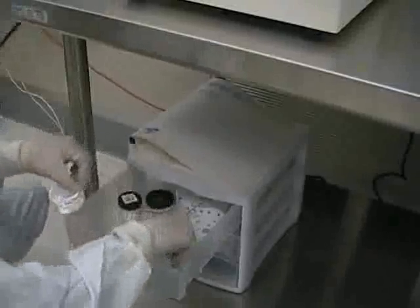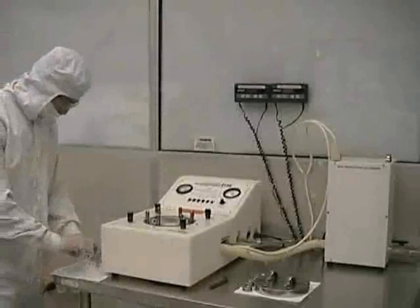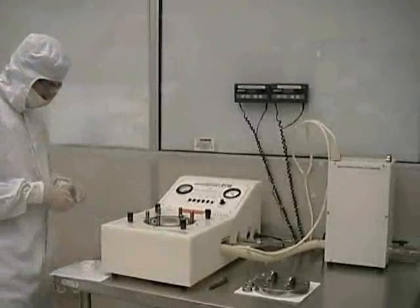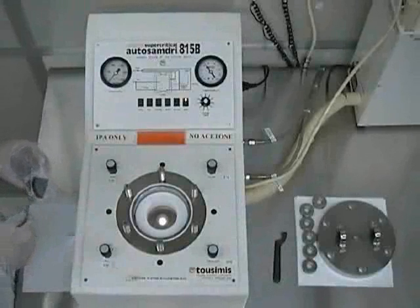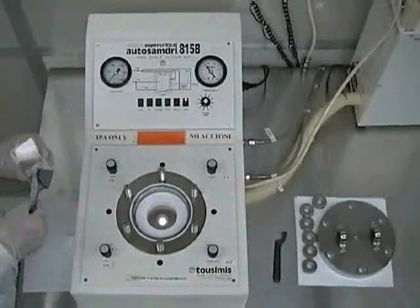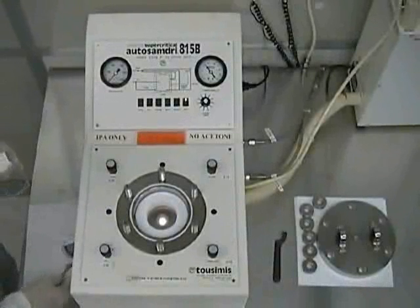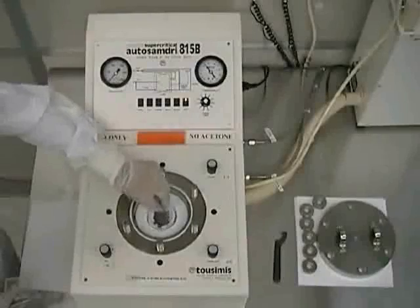While the unit is still warming up, you should carefully and quickly transfer your wafers from your wafer container into the proper size wafer holder. First, place the spacer ring on the bottom of the wafer holder before putting in your wafer. For the best results, you should minimize the amount of time the wafers are exposed to the air. Once the process chamber has been properly sized for your wafer type and your sample has been loaded into the correct sample holder, you should then place it in the process chamber.